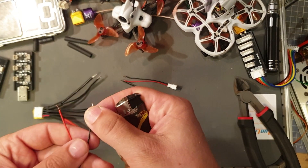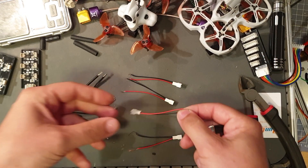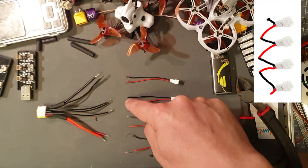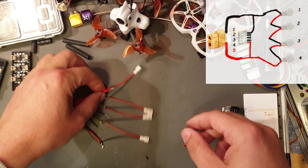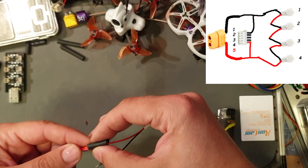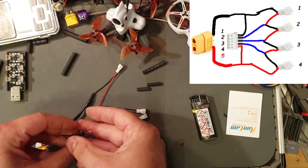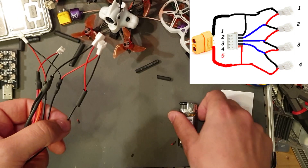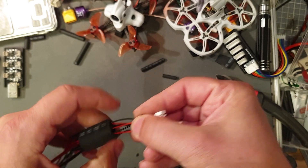For strapping wires, I've been using this method for a long time and I'm going to keep using it — it works for the smaller gauge wires. Now we're going to solder the PH2 connectors in the cells like so. Then solder the second wire from the balance connector to positive on cell number one and negative on cell number two. At the last step, solder the last two wires as shown in the picture. Then add a larger heat shrink tube to keep it together — it looks nicer too.